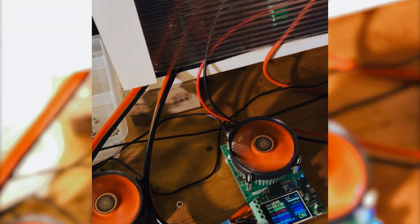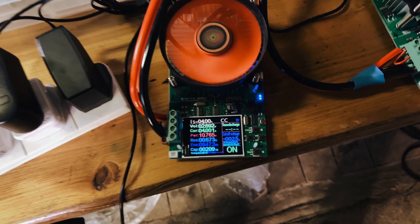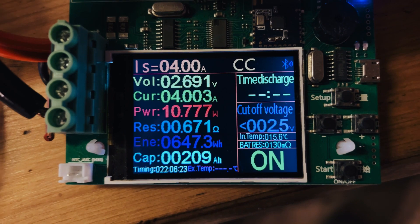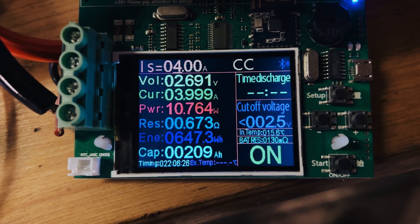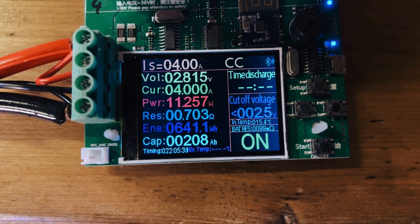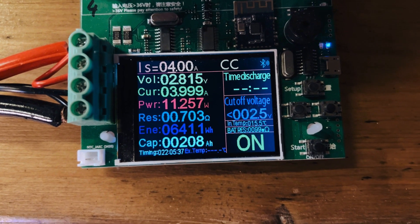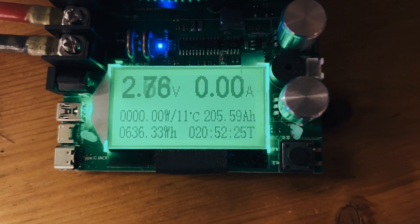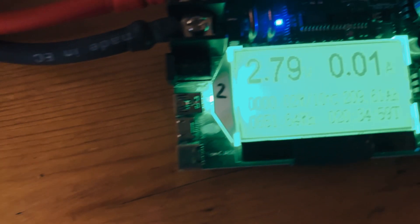Just under 1.5 and here's on a different rig: 1.45 and 1.47 because we're slightly higher on this one. The four testers are checked — they're within about one and a half percent of each other — pretty accurate and good enough for what we want to do. Cells are being kept warm behind there. Fast forward about 20 hours: this one has just clocked up over 209 amp hours and it's still going. This one's running at nearly 209 as well. This style tester stopped at 205.6 — a lot lower than the others. And this one stopped at 209.6, so quite a big difference between those two.